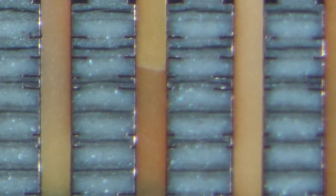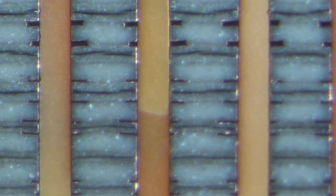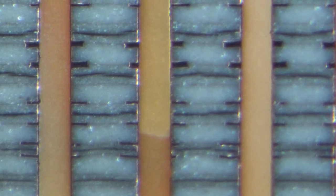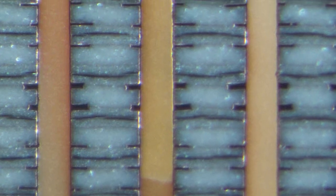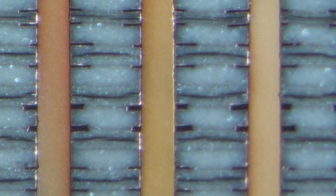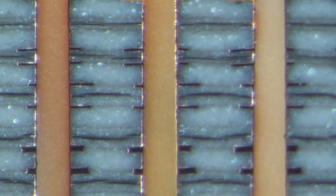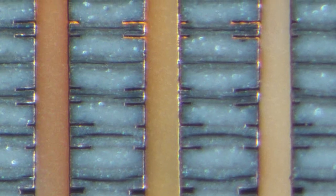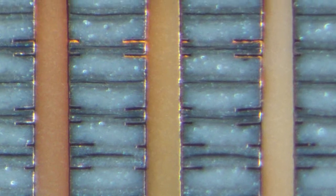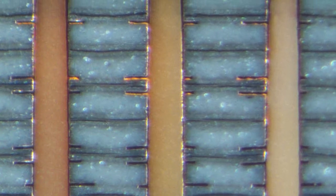In this image, we are looking at a cross-section from a 30-layer all-PTFE construction. High-quality holes that are free of nodules, interconnect defects (ICDs), and voids are possible when proper drilling, preparation, and plating are understood — such as types of entry and exit materials used, controlling feeds, speeds, retract rates, and hit counts, use of direct plunge versus peck drilling, post-drill hole clean, and surface preparation.